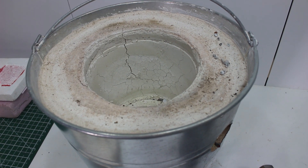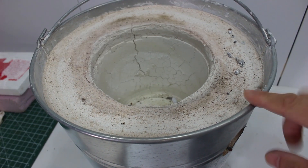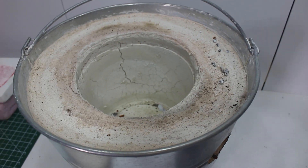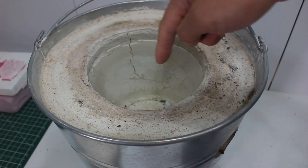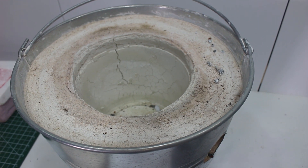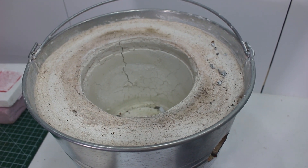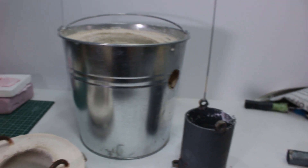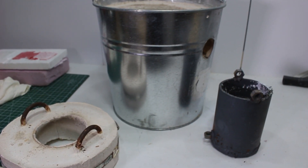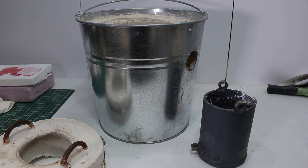Check out the rest of this video of me melting aluminum cans, but I'm going to redo this in the next few weeks or months. I'll line it with mineral wool or K-wool, make a proper lid out of ceramic board, and coat it with a proper stabilizing refractory over the wool. I expect really good results with that setup. It just isn't as efficient right now — it uses way more fuel, and the savings in fuel alone will pay for the refractory itself, even though the refractory costs a bit more and may need to be ordered online.